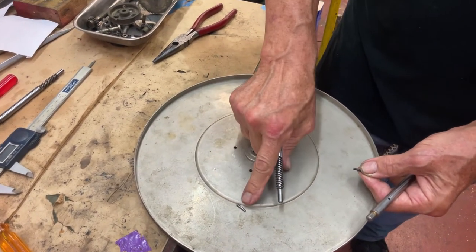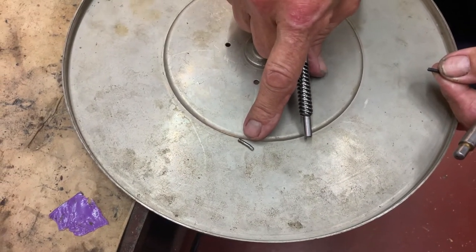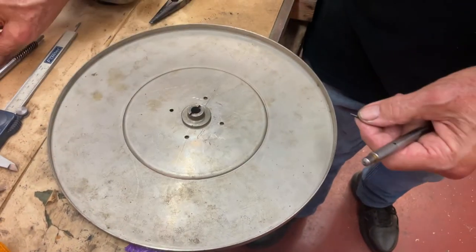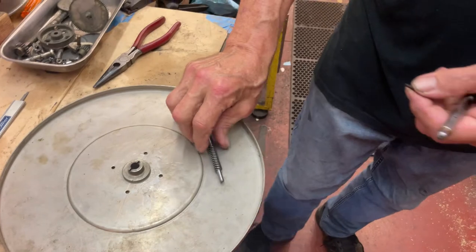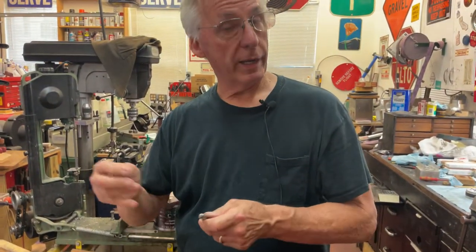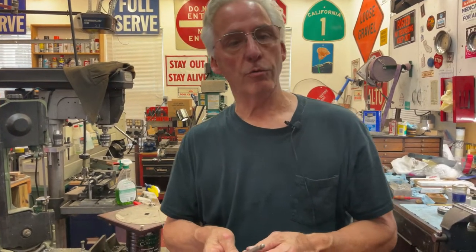This is an original pin. It had broken off at one end, and the center of that is .09, for a 0.090. Some of these spindle shafts are case-hardened, so when I get into the video talking about drilling — if it starts making a screeching sound, it's case-hardened and it won't drill.